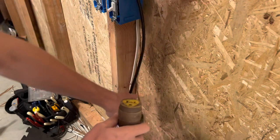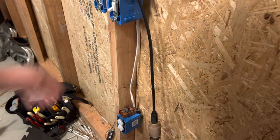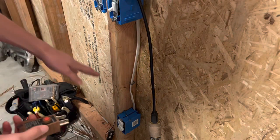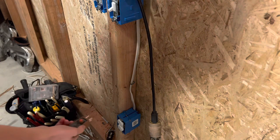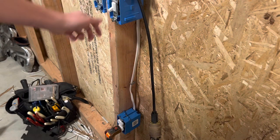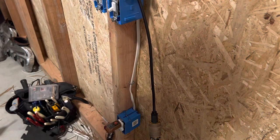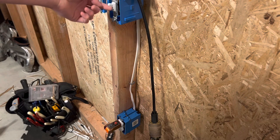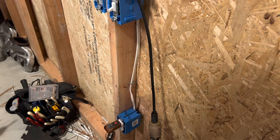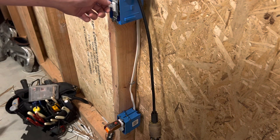Now we're ready to plug this in. I'm going to go ahead and plug this in — it's in the off position right now. We have our switch right here; nothing's blowing up. The plug on the bottom is always going to be on, so constant power is there and hitting the switch won't affect it. When I plug my plug tester into the top outlet and hit the switch, it turns the power on and then off. That's how the half-hot switch works: power is always on one side and the other side is switched by the switch — whether that's a single, three-way, or four-way.